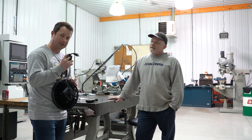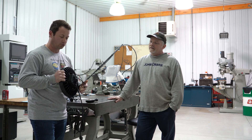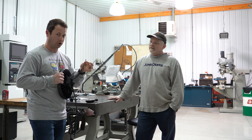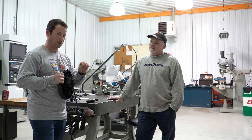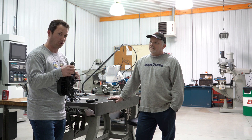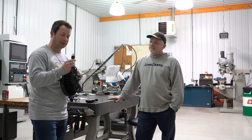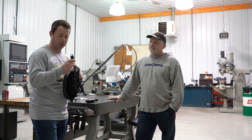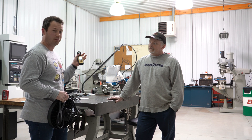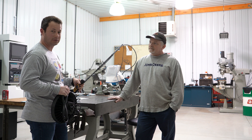This new LED has a 110 plug, and it also has these other wires for a dimmer. A lot of the true dimming LEDs have a 0-to-10 volt or 1-to-10 volt dimmer circuit that requires a special dimmer — we're not going to hook that up. We're going to have these running full tilt. They actually accept 110 or 220 as input; it says it can take up to 277 volts in, but we want to convert and use the 110. So we'll measure lux before and after once we swap out two of them.